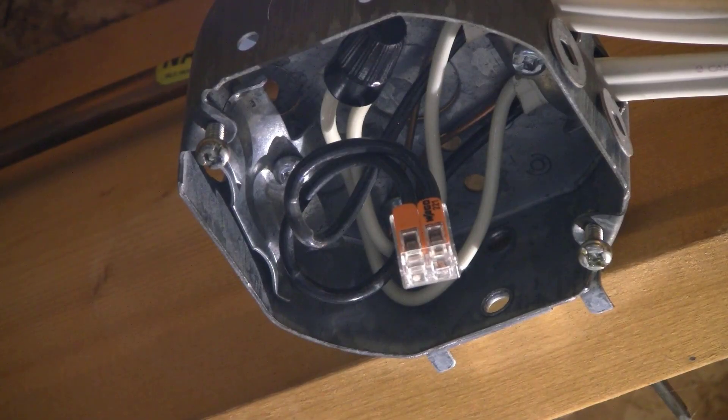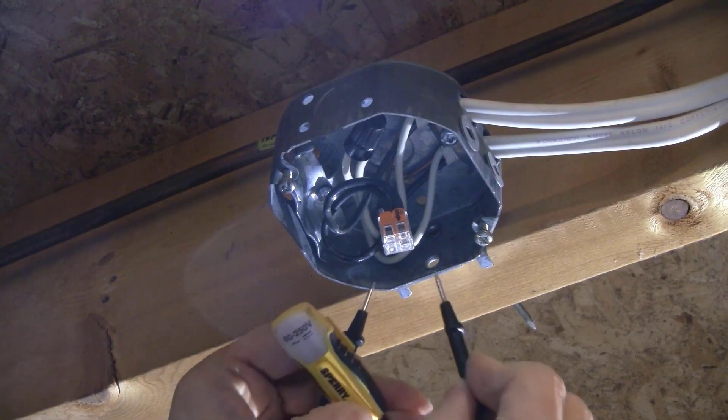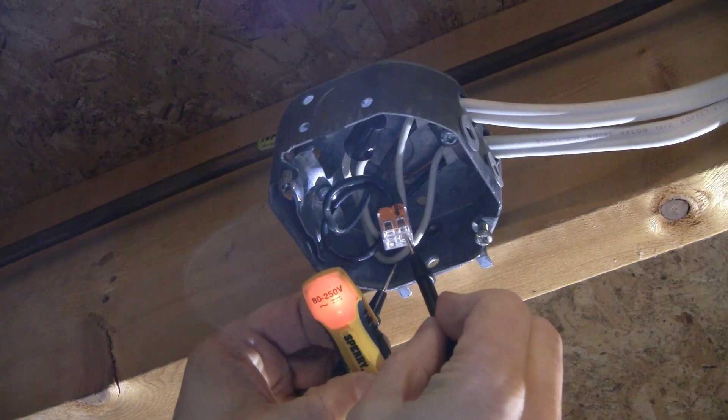If you see two groups of black wires in a junction box, it's likely there are two live circuits coming into that box. Make sure you test and turn off the breaker for all circuits coming into that junction box before doing any work. Testing if power is off to wires in a junction box is even easier if you've used WAGO connectors instead of typical wire nuts. Every WAGO connector has one slot that is open on the back for testing. The probes of the Sperry ET6102 can fit in this hole, so you can see if the box has live power without having to expose the wires.